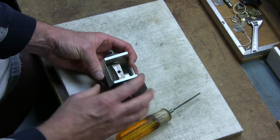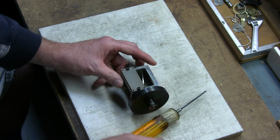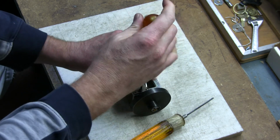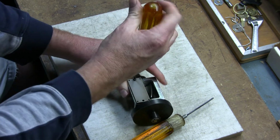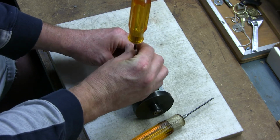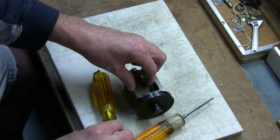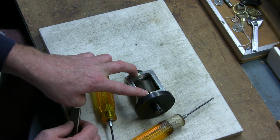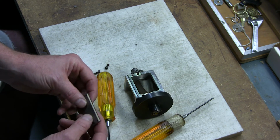And now that's the turning and/or replacing of a rotating blade. The stationary blade, you can just lay it down as well. Remove the number 6 socket head cap screws. And we are simply going to turn them. And here are your two set screws for the adjustment of the stationary blade. Turning them clockwise pulls it closer, counterclockwise pulls it further away.